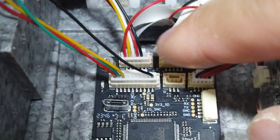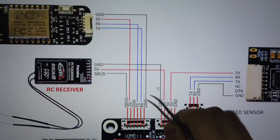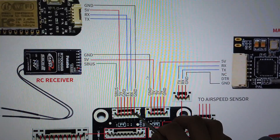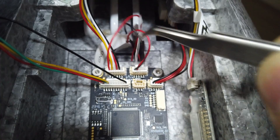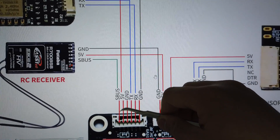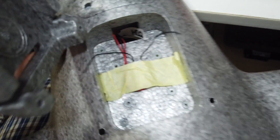So in the end, this is how I wired it up. On the six-pin connector I had one pin removed. The Wi-Fi module requires only four wires — ground and 5V using pins 2 and 3, though the wiring diagram uses pin 6 for ground. RX goes to TX on pin 4, and TX goes to pin 5. I had to swap the wires and pin-out of the connectors. The black and red wires are for receiver power, and the red color on pin 1 is for S-Bus to the receiver. The receiver is temporarily taped at the back.